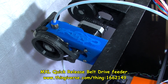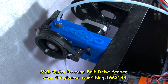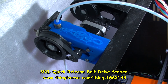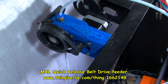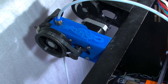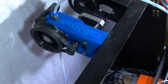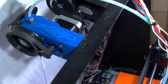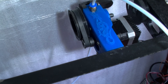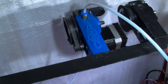The one I'm printing now has two nozzle inputs — well, two Bowden tube inputs — one feeding out and one feeding in. This one does have a tube feeding in but I had to force the fitting on the bottom, just the same as on the top there. I had to force the fitting into the plastic — not ideal. So that's one reason I'm printing it again, because the new design actually has a designed-in place for two Bowden fittings — one on the bottom and one on the top.